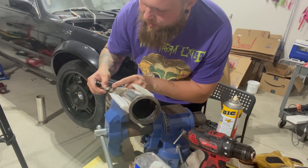Now we have to get the next part ready for welding, which is drilling the hole for the wastegate return — where the wastegate connects back to the exhaust so it's not just an open wastegate tube that's obnoxiously loud. I'm going to mark that, center punch it, and drill it with the bigger hole saw. Hopefully it goes just as easily, and then we'll start welding.